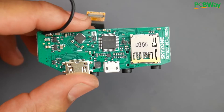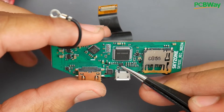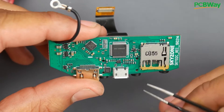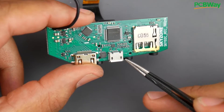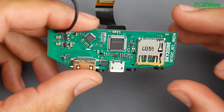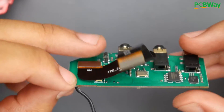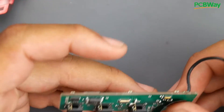I really love these — I want to try to implement these. What they are is kind of like a four-way resistor — it's one package that has four resistors in it, usually with the same values. It's really nice, especially for quadcopters, because usually you'd need individual resistors on the input and output when using STM32 flight controllers. I really want to see where I can get them from, hopefully not expensive. I just want to try one in a build — I think it'd be pretty interesting. I don't know what each chip does here, and hopefully we never need to find out, because if we do then something probably happened.